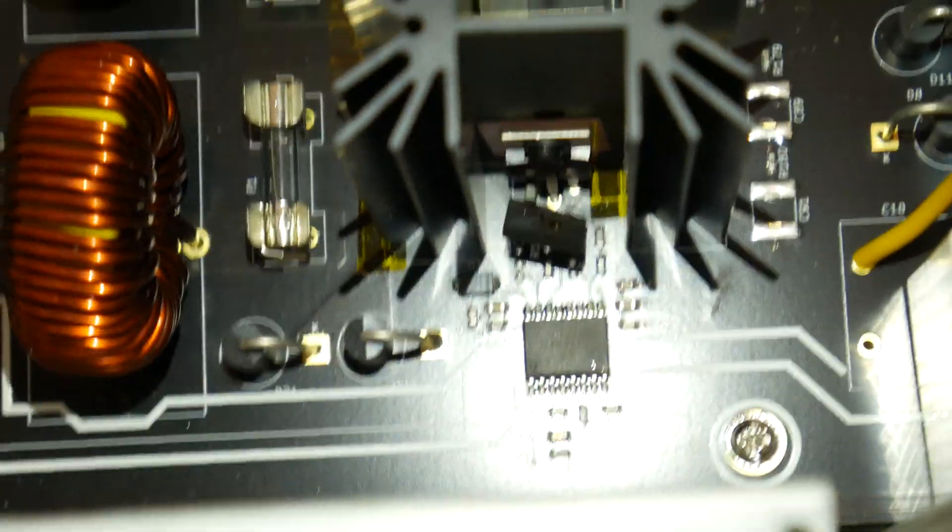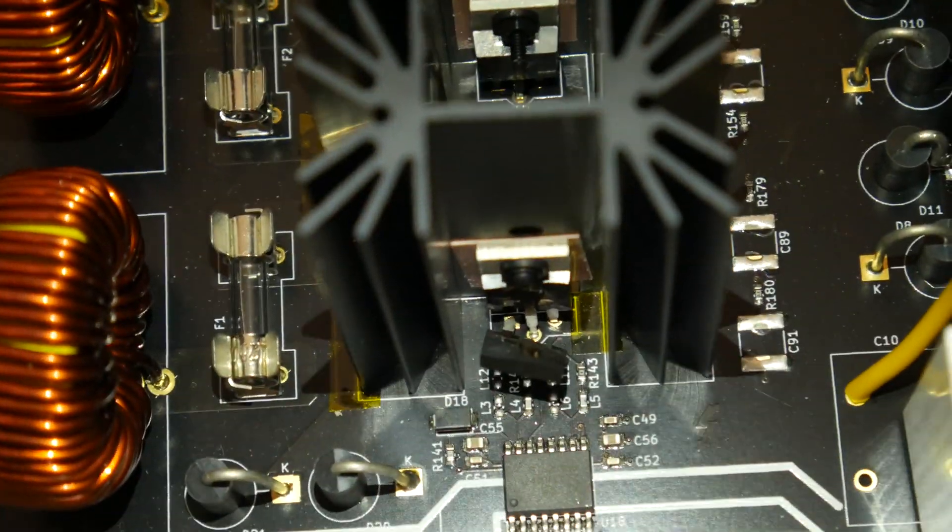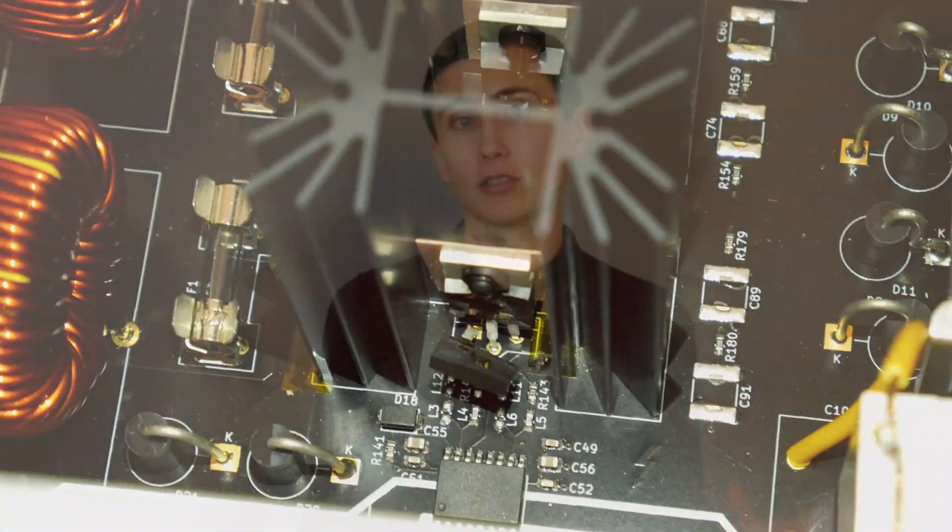I'm looking for hundreds of watts and we never really saw more than a hundred — not ideal. There are a lot of issues that were uncovered: little things like the output filter inductors getting too hot, but also big things like transistors blowing in half. There are many points where improvement is probably required in our design. Let's start with the pieces of our design that we're very happy with and will carry forward into phase 2 without any changes.